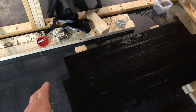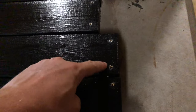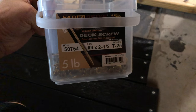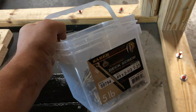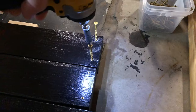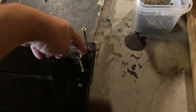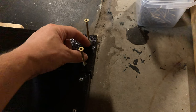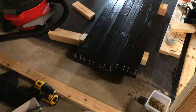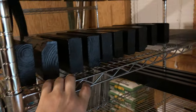Of course, if you haven't seen those videos, go to the homepage and check them out. We drill some holes all the way through, clean it up, stick to the outside corners. I'm going to get some two and a half inch deck screws — I like Deck Mate, to be honest; just what the local store had. We prep these, get them as straight as possible, and stay to the outside corners because when we screw into the side we leave some meat for those screws that are going to come into the side of the legs.